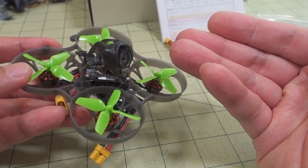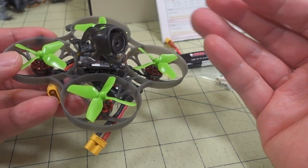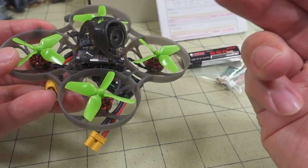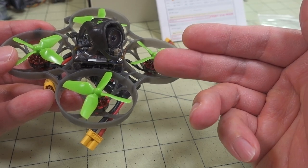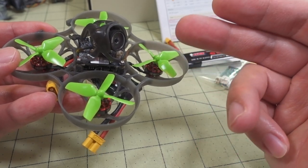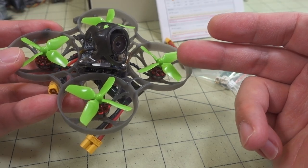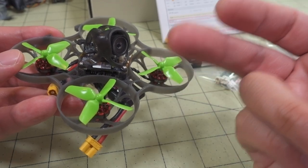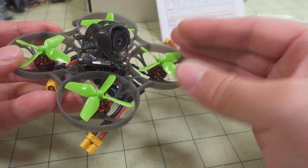The flight you're going to see at the end here at this park was not super windy, but it was about 5 miles an hour wind. You can't really tell in the video, it's actually got a pretty good pitch, even though it's running an older version of Betaflight, 3.57. The product specs say it's running 16.8 in terms of the ESC firmware, so I suspect they're running 48 kilohertz Jazz Maverick firmware on the ESCs so you get a little bit better flight time. But of course, since they're running 3.57, there's no RPM filter. Still, the pitch tune seems pretty good for something of this size.